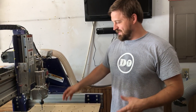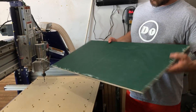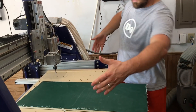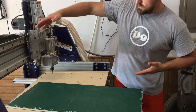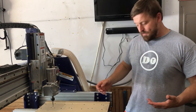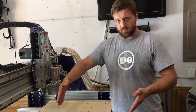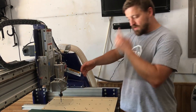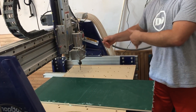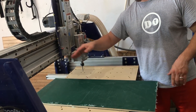The concept of tiling is — let's say I wanted to put a design on a board that's longer than my table is wide, and I want to engrave down the entire thing. Thankfully, a lot of design software comes with an automatic tiler where you specify the width that you want engraved, or cut, or whatever is being done to your piece. Then, as long as you have the proper know-how and system to shift your piece the exact amount or distance you specify, it'll continue picking up and do your design further down the line.